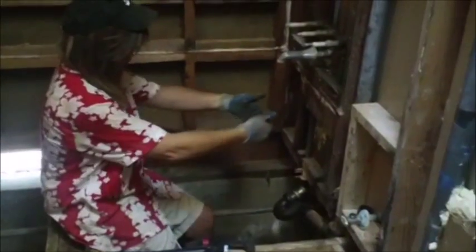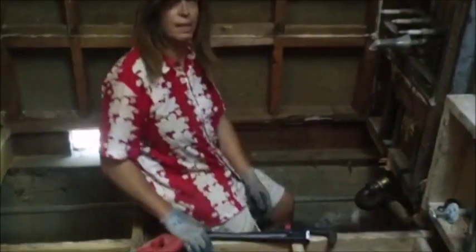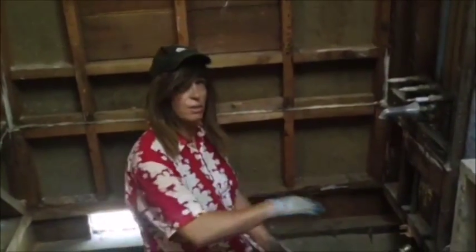But over here it's a little too close to the wall, so I'll be able to put a 45-degree bend in here, and then move it out to a location that'll be about 10 inches away from the wall area. And with a linear drain, and I don't guarantee it, we drain slightly from the back wall. We want to bring this drain about a foot in, and then we slope from the back to the front here. So we want to make sure we don't have our drainage so everything's just gone downhill. We've got to move it over in this direction some.